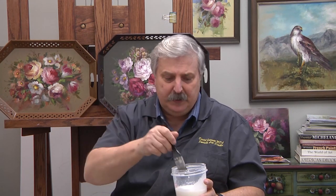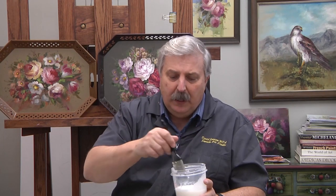A lot of people think that your varnishes have to be wet all the way across to get a real nice coat onto it. In a lot of the older varnishes, that's true. In the newer varnishes like this, that's not true. You can keep going. I'll show you how to keep a wet edge, but you can just keep going. Let's just start with this.